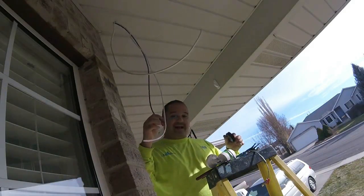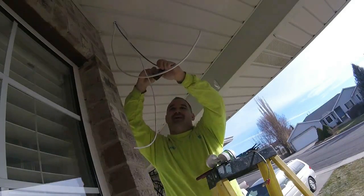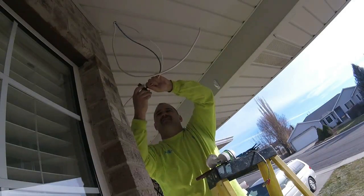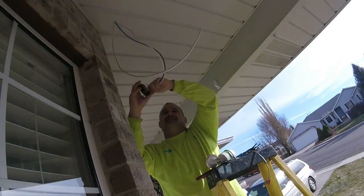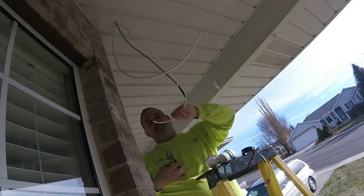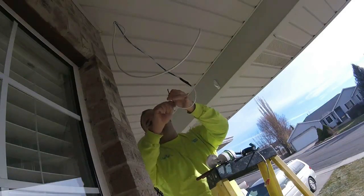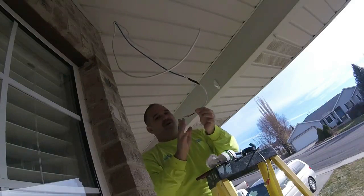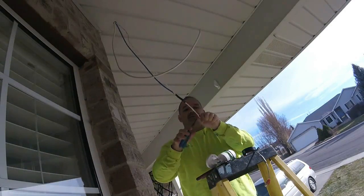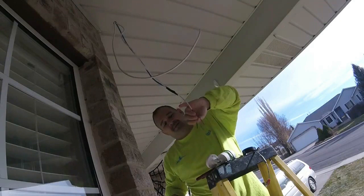The CAT6 cables are for future use, so I'm going to push that up there. If I just push it inside the hole it's gone forever, so what I do is tape it to one of the other wires so when I pull this wire out the CAT6 comes out with it. This is my power cable, the 16-2. Give it a little nip on the end — my wire has string in it, so after you nip it, pull the string. The idea is that when you nip it you might nick the wire, so you pull the string and that strips the jacket back without damaging the wire. Cut off the jacket and cut off the section of wire that might be damaged.